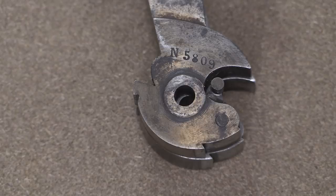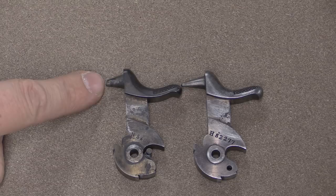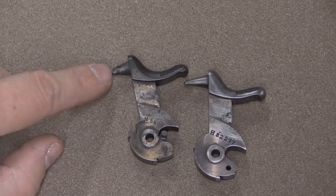The proper way for me to fix this problem is to actually get a gunsmith to weld on an extra blob onto the end of this clipped firing pin, and then machine it down to the original profile. That way all of the very delicate hand-fitting of these engagement surfaces is still usable and I don't have to mess with it. The firing pin itself is a much lower tolerance part — all it has to do is hit the primer and fire the cartridge.